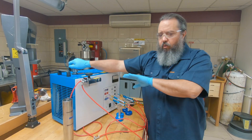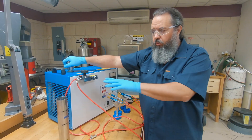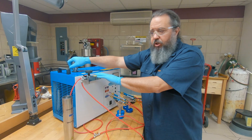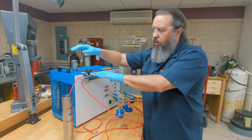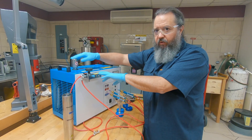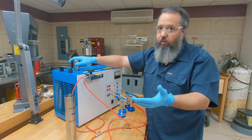If you do this backwards — if you open up the pressure cap before you take the booster tank off — the vacuum that's in this machine can actually cause flux to be drawn into your electrolyte tank. If you do that, you're going to foul out your solution, and then you're going to have weak flames or maybe no flames at all.